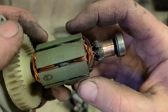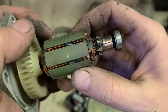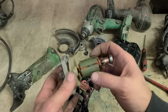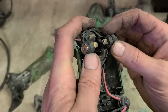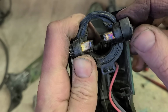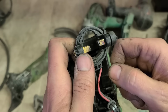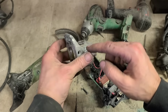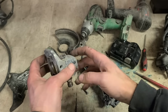It has done a little bit of work for a cordless grinder, especially a Hitachi one. And the way this is melted, and the fact the brushes still have a chamfer on them, see from the end, suggests these aren't old. Check this first, because this was in before. This was in twice before though. Two different numbers. See what was done the last time.